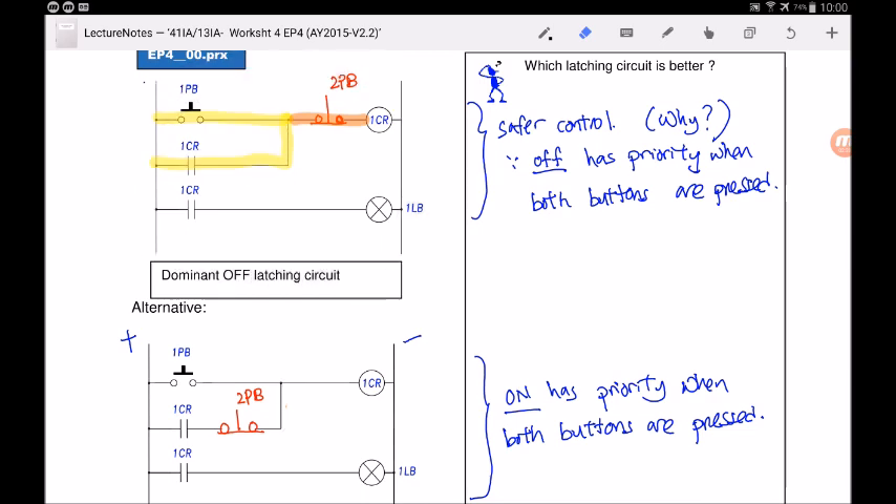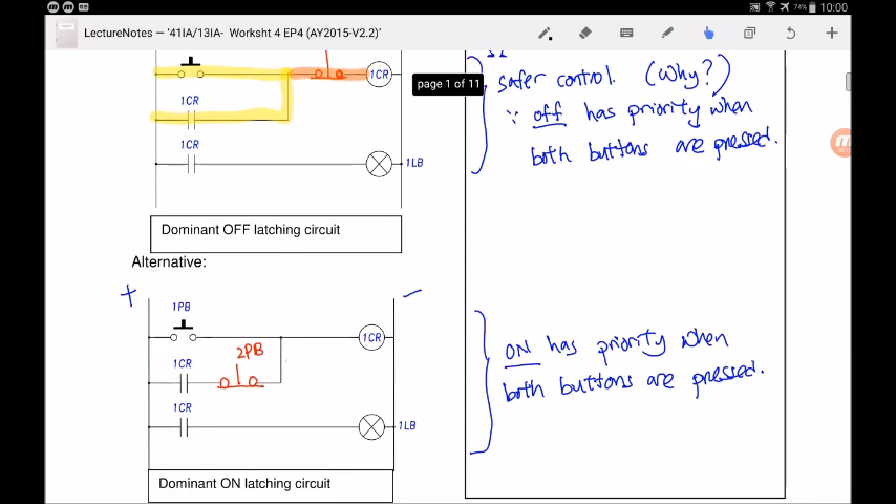The highlighted yellow portion of the diagram is the start condition; the red portion is the stop condition — also called on and off conditions. Things always have a start and a stop: who turns on this thing, who turns it off. This is a template for designing control circuits — not a formula, just a framework to fall back on.